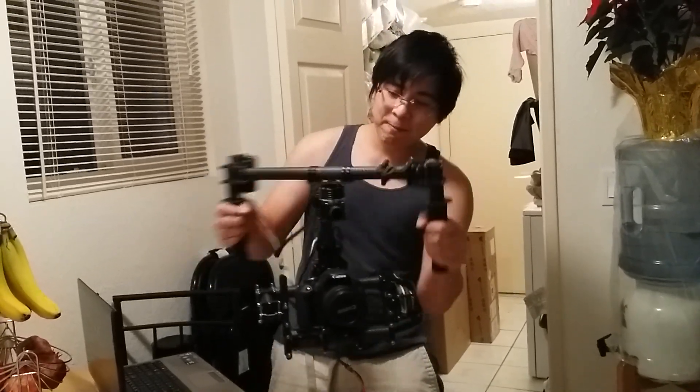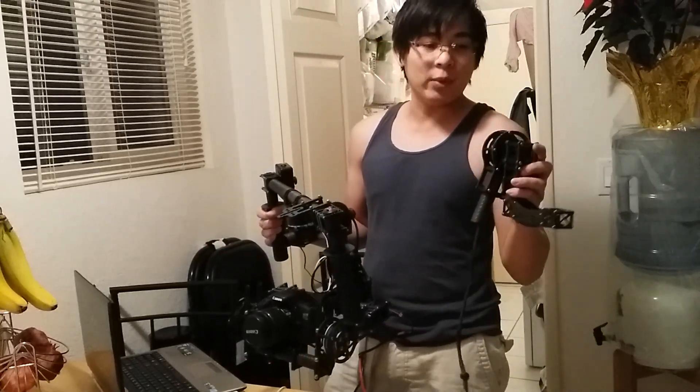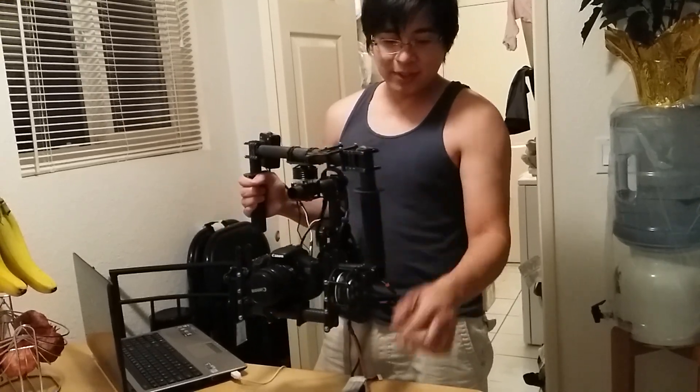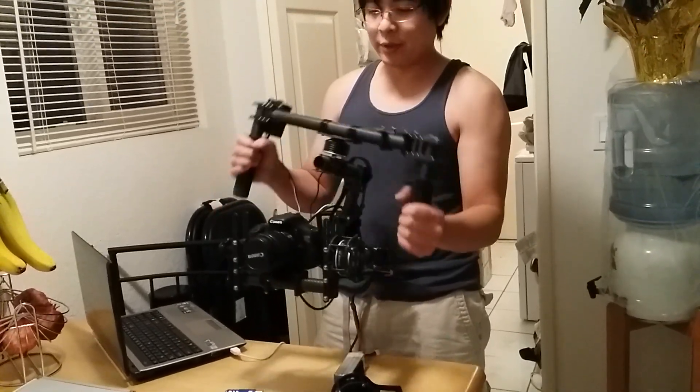Once again, it's a 28-pole motor — very, very nice. It's a higher pole count, and it's way better than this iPower 5108 22-pole motor that I'm testing out. I have an extra bearing cage on the 5108, but this one has no bearing cage and it feels just as nice and solid as the 5108 does with the extra bearing support.